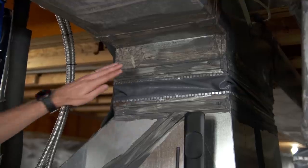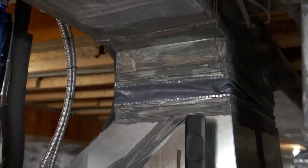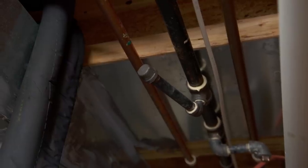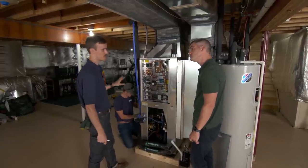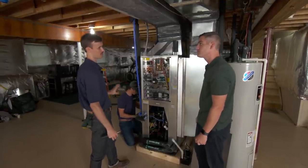You can see here we've cut off the existing ducts and added our new system in with flexible duct connectors. So it's pretty much plug and play — connecting between the supply and the return. The home used to have an air conditioner outside and a natural gas furnace inside. We've pulled that old unit out — coil, condenser, furnace — and we've capped the natural gas lines. Now we've got one single geothermal unitary system, so no more outdoor condenser. You'll also notice that one of the things you'll typically see in a geothermal system is a separate pump box — we've put all of that into one unit to make the installation process faster and smoother, since installing things in the factory is much faster than doing it in the field.